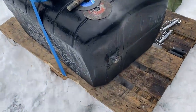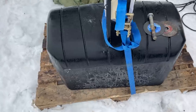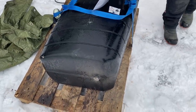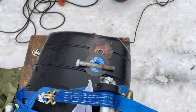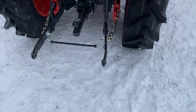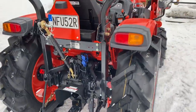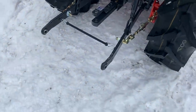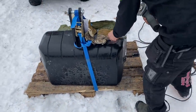And the trouble with this one is it came with bigger size tractor mounts. It's for a front mount for a modern 200 horsepower tractor. So we're gonna stick some 19 mil bolts on to enable us to fit it to our hitch, because we've got a, I don't know which category hitch it is, but it's smaller on a compact tractor obviously. Now I can lift 1.5 tons on this, but only with small pegs, and I don't trust my welding, but I do trust Vin, so.